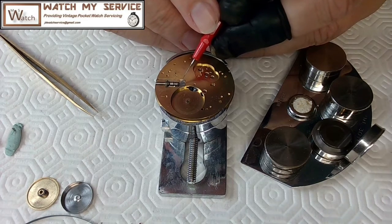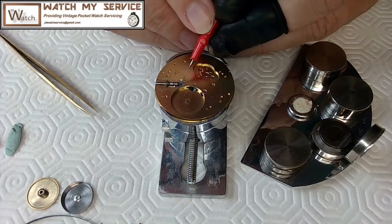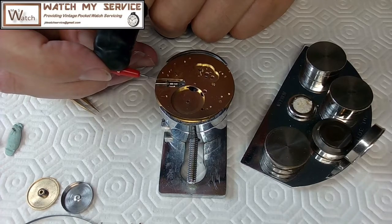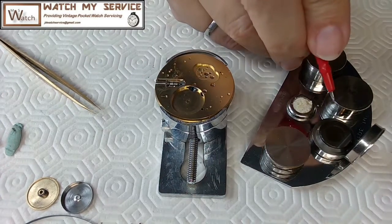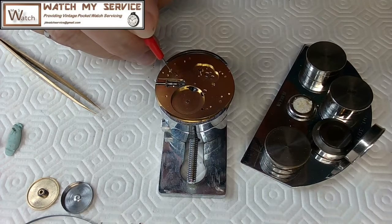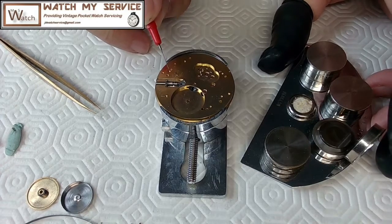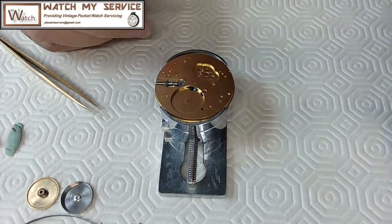The cap of this also needs oil because there's a cam that kind of touches that. That's probably all you need for that. You can put a little bit on the gears as well, which might help — you just need to put it on a few of them and it'll pass itself around. A little bit reluctant, but I can put a tiny bit on these teeth here just to pass it along to the inside where that wheel is. I wouldn't bother oiling the clutch over here.